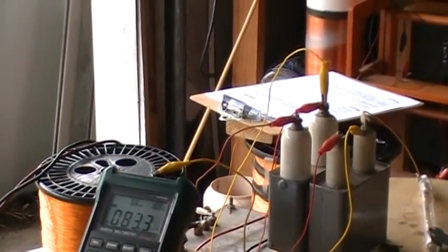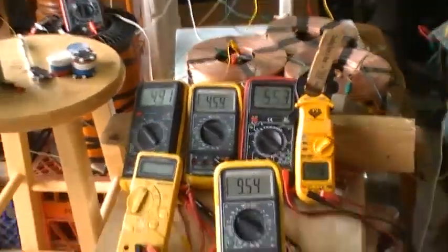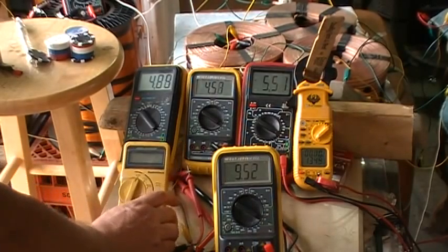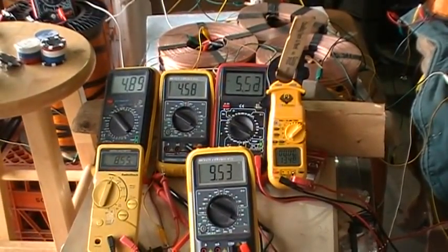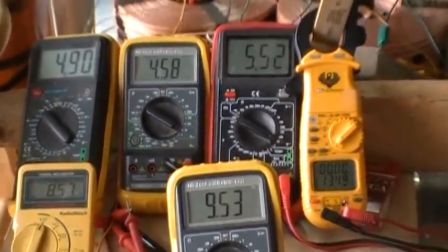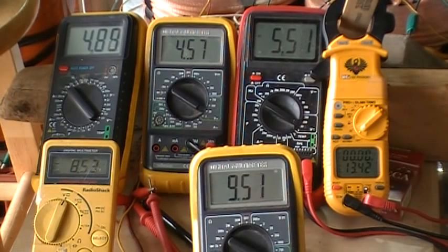The resonant loop itself. The primary amperage went down to 0.21, a 6-fold drop. Then our new problem becomes this. Both of our phase angles look relatively large, almost 180. We got 85 between 45 and 49. We got 95 between 55 and 45. And we have a net voltage pushing 13.4 volts into the transformer charging that cap.